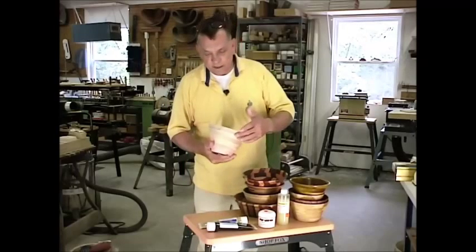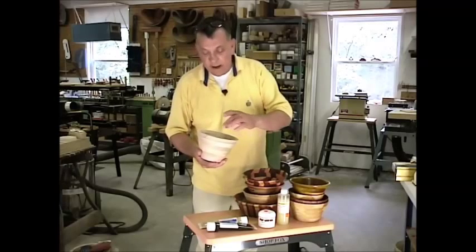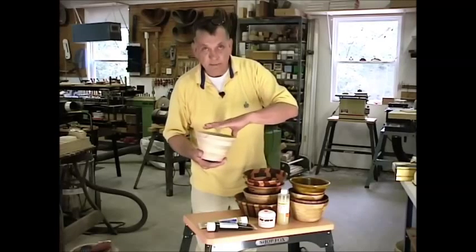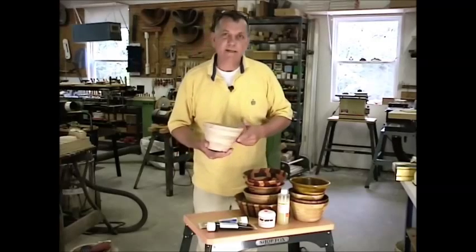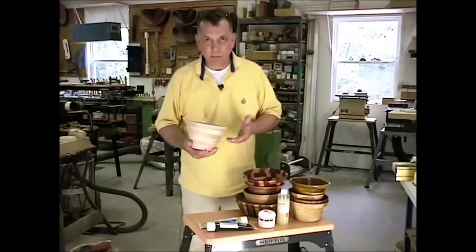What I've found is that as we're cutting a piece of wood and cutting that circle off, we obviously have end grain on two sides of the bowl. Penetrating stains tend to really soak in heavily into end grain, which tends to give you a very, very splotchy bowl.